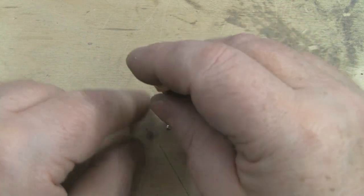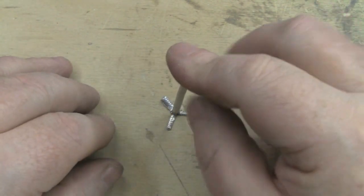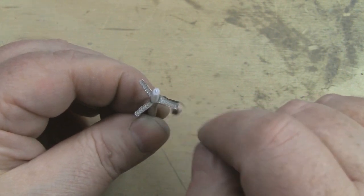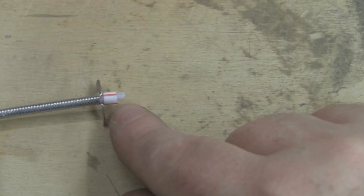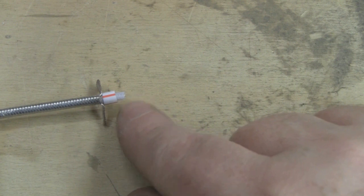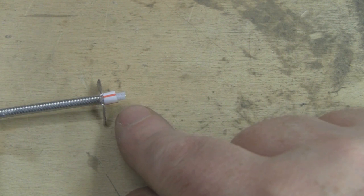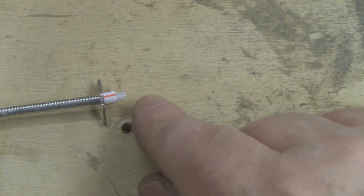Use a hole in your board to help get them all nice and straight. Trim off the excess length, then fill a little bit of solder in there to create small solder cups — this makes for a more stable antenna. I've cut a piece of straw four millimeters long to use as a guide to cut away the top part of the dielectric for soldering the top part of the elements. Keep it to about four to five millimeters maximum — going beyond five millimeters with this design causes SWR to climb and will impact the antenna's performance.